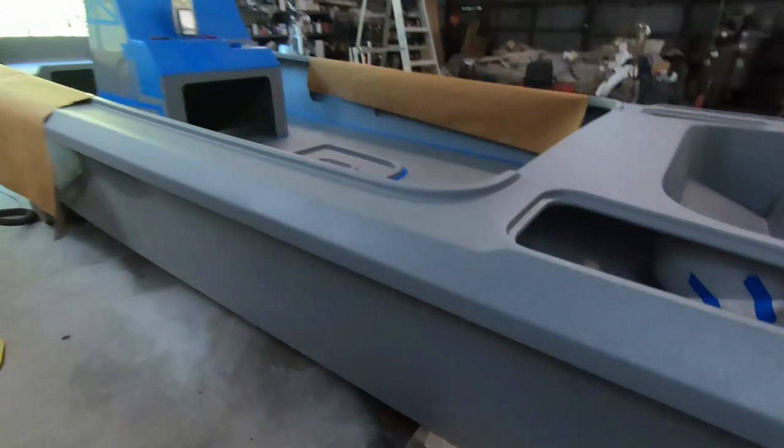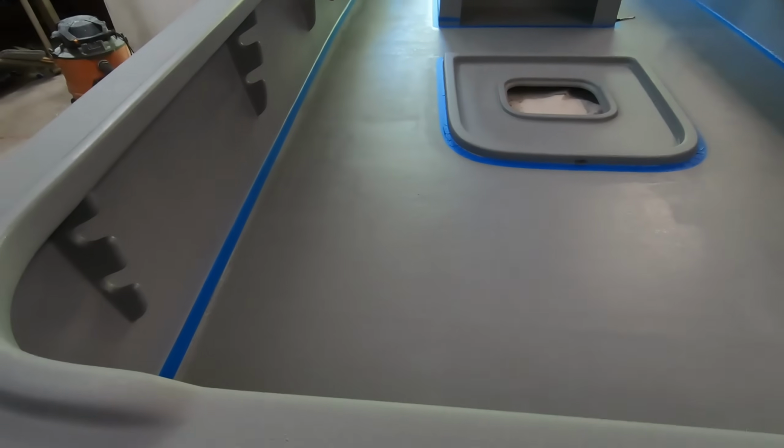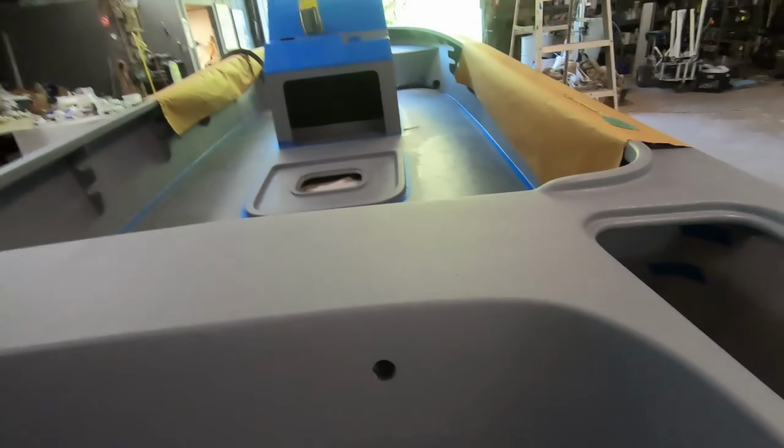And I hope you can see it turned out quite nice. We're using just gray on gray, but we taped it off, bordered it, rolled the non-skid on there, and then transitioned into just a roller finish. And we're fixing to move to the floor. So you can see we've got it bordered all around. We're doing a little bit of light sanding, and we're prepping.